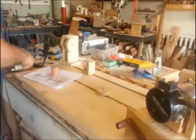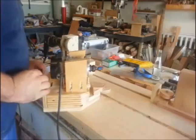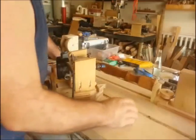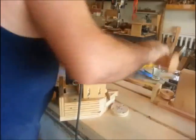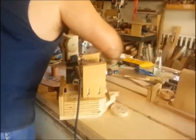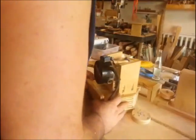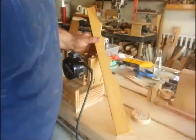What's really cool about this template setup is you can just put a regular leg in there that you want to duplicate and then follow it along with your pattern on your router sled. Or you can make your own template by just putting a couple of blocks in and fastening into those template guides. You can go along and follow a template — basically draw out any pattern you want and duplicate anything.